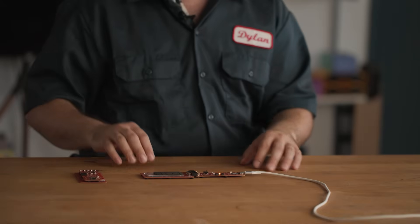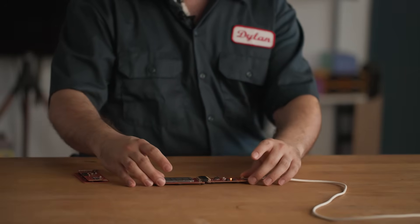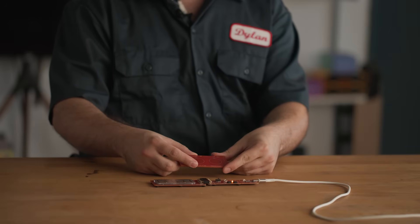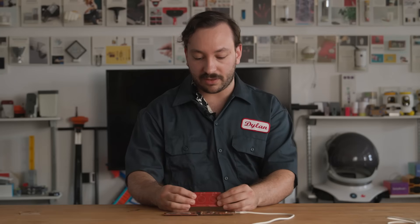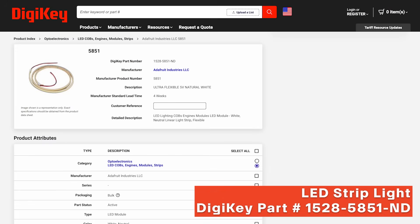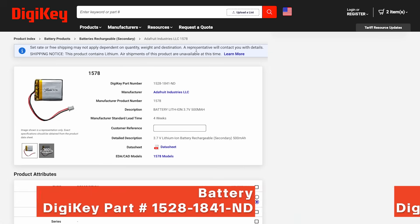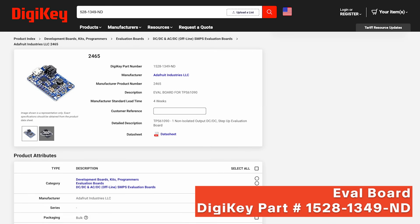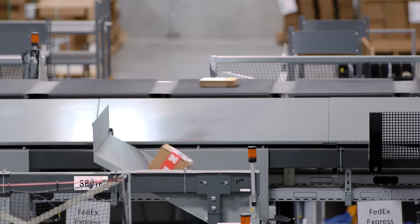I have to take this and turn it into a small form factor that can actually fit in our light. I'm doing that by taking this board and cramming it together so that the coils are on one side to detect button pushes, and the dev board is neatly in place on the other side. Sandwiched together, it's small enough to fit into our light. For this project, we ordered a warm LED strip with a high density of LEDs, magnet wire to connect the LED board to the dev board, a battery, male headers to sandwich the two dev boards together, and a battery charger that adds a USB-C port. With Digi-Key's fast turnaround, those parts will be on our bench in no time.